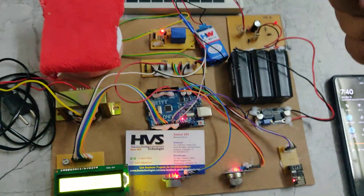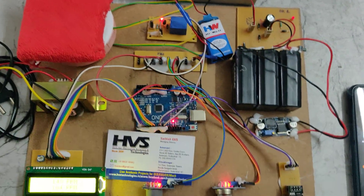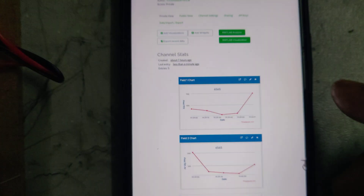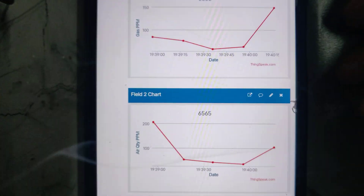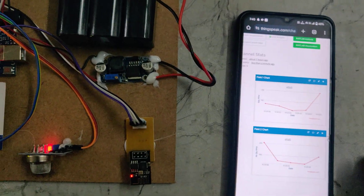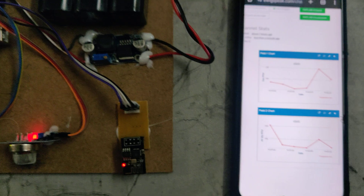In this manner, solar-powered air quality is monitored continuously through the cloud platform, and air quality is controlled with the help of the air purifier via the Arduino Uno board. Live data is uploading to ThingSpeak now. The data is uploaded to the ThingSpeak cloud platform every 15 seconds, which is the minimum accepted interval for data uploads.